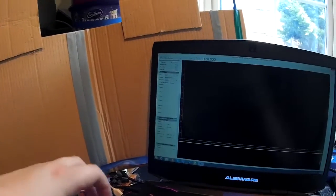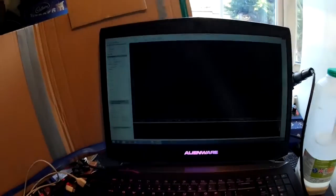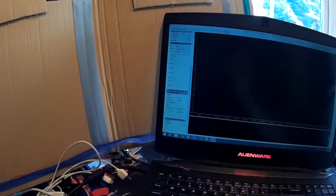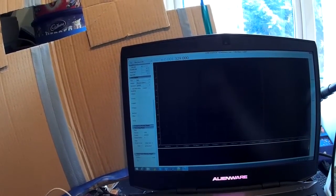I've never used it, really. I have, but when it's plugged in, because I have a plug set up for my tools on the workbench, like my soldering iron and hot glue gun, wow, loads of noise came up again. So the power supply inside of that is rubbish. The switch mode power supply for my laptop just dominates the spectrum. But you'd expect that, wouldn't you? Funny enough, my fan doesn't seem to introduce any noise. I had a quick check earlier and didn't notice any problems, so that's nice. What else is there? No, I think that's it.